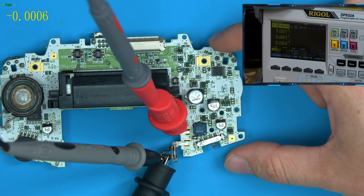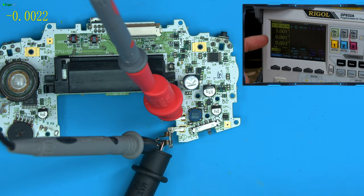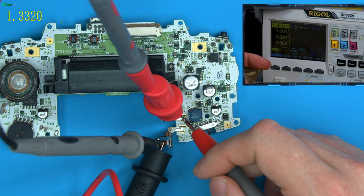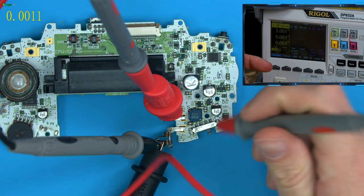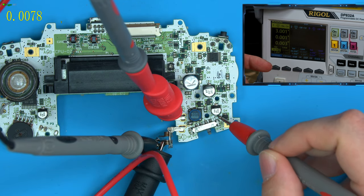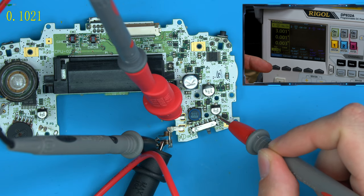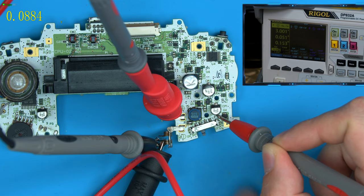So we have power on the board now. And we can see that it's 3 volts. We can test with the multimeter, and this shows us that it's 3 volts. And now you can check the C pin, which is the power to the board here, but this capacitor here, CP1, is also the same thing. So you can see the minute that's got nothing in it. If we turn the console on, you can see it jumps to 3 volts, and the system's booted.